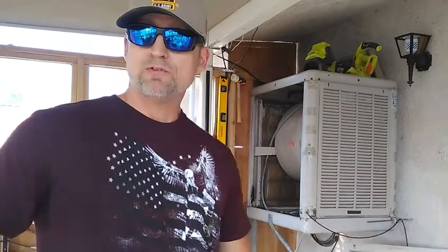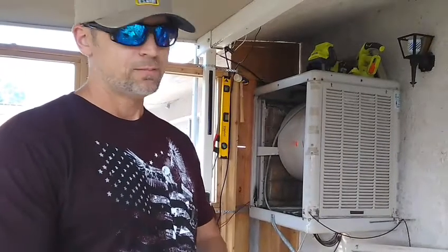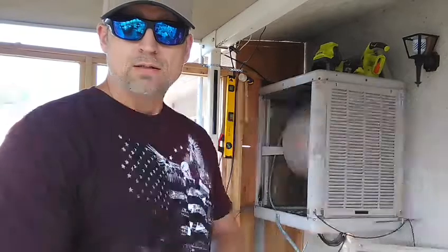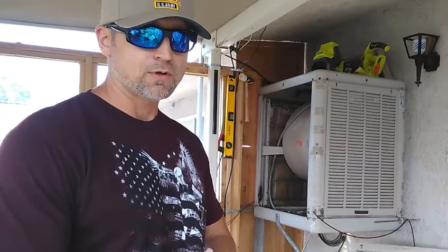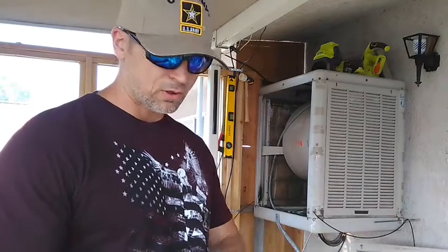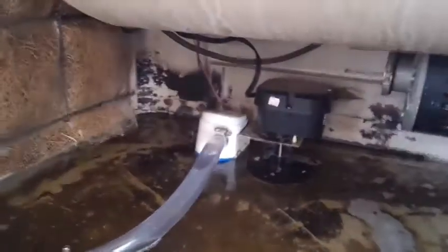Not only does it save power and save money — that thing was still costing electricity — now I can run it off grid with my solar panels. It's 130 watts to run versus 500. I didn't video the conversion process because I had to exchange parts a lot and figure out what worked and what didn't. I've got a system that works, so I'll share with you the parts and my setup.